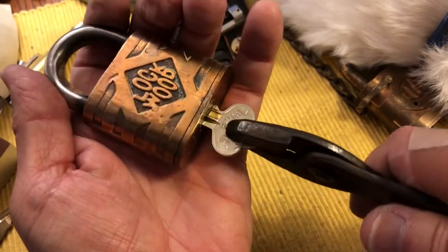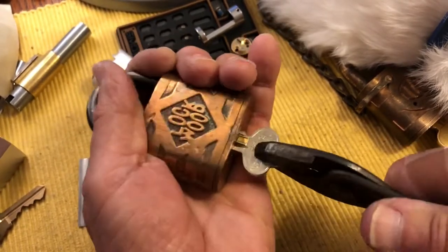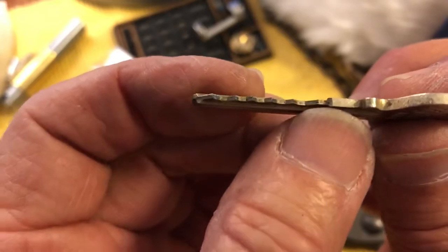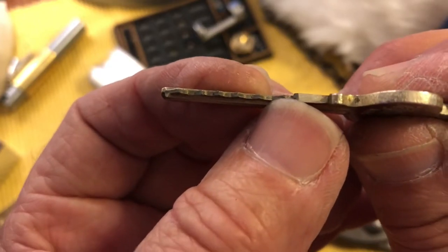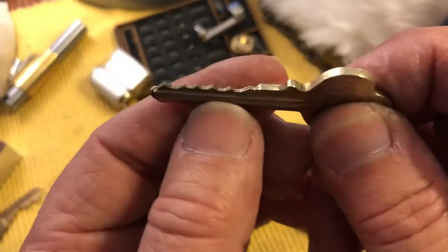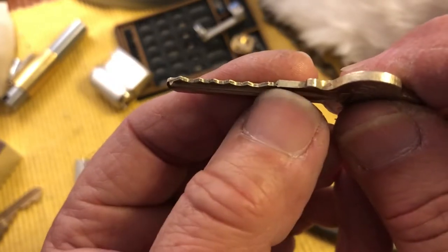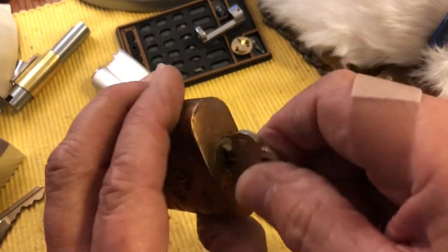So you try an impression. You take your pliers or vice grips and stick it in there, pull it out, take a look at it, and you can see right in here you have little tiny rub marks. The idea is you file very slowly and file these rub marks off. Do it again, and eventually it doesn't mark anymore — that means the pin is hopefully at the right depth. So that takes a long time, a lot of patience, but that's one way of doing it.